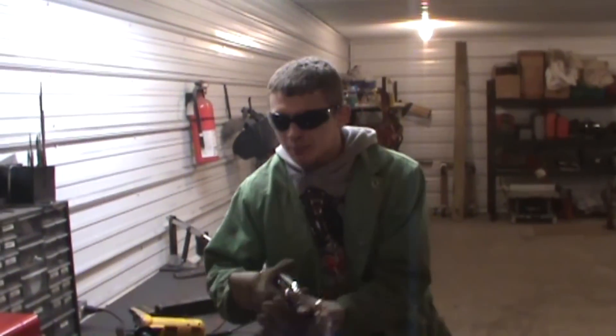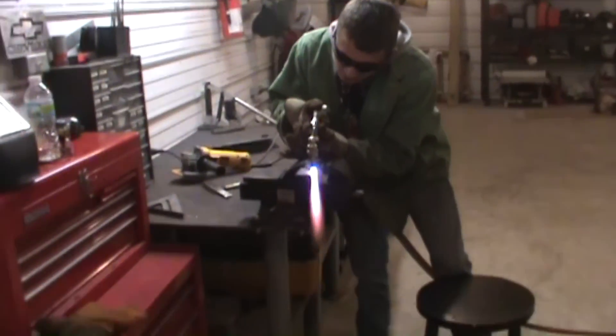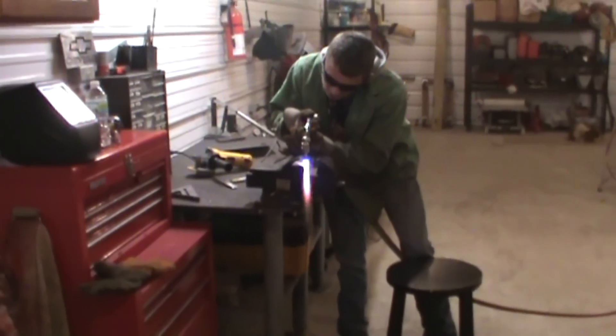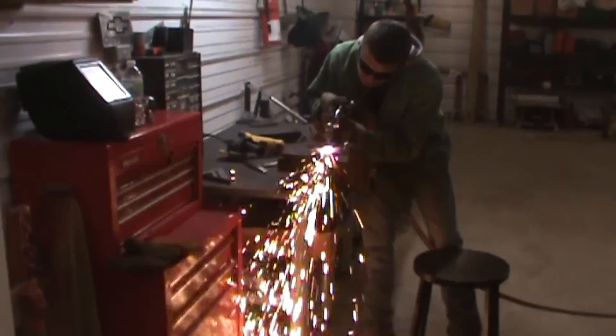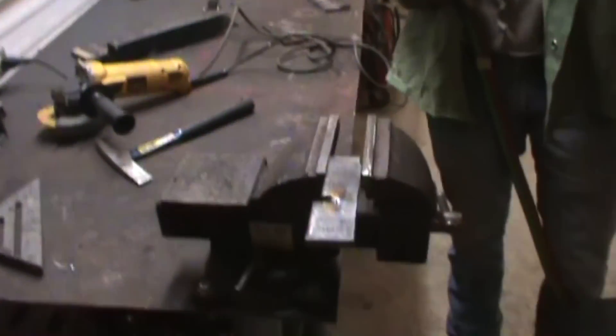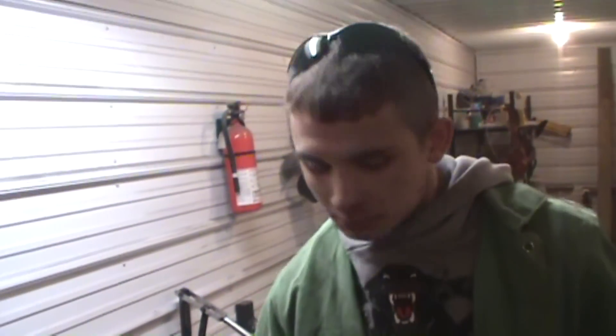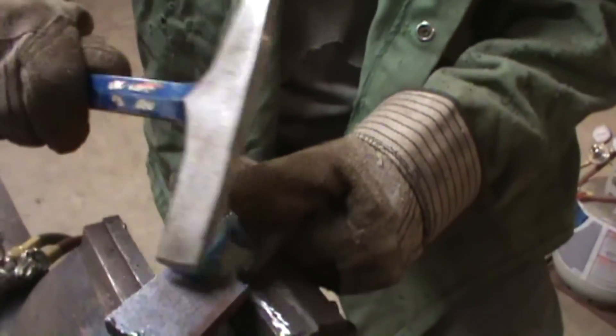Another thing is the preheat time — this metal is completely cold. You're going to see it takes maybe a little bit longer, but not that much longer. So here we go. As you guys can see, if you don't have much extra time to spend waiting for something to preheat, you're probably going to get in a hurry — you should just get a plasma machine because that really did not take any time at all. Again, that's about three-eighths plate, completely cold when we started. And as you can see, those cuts come out pretty daggone nice — minimal slag on the back side and it knocks right off.